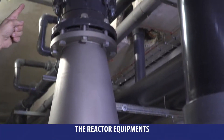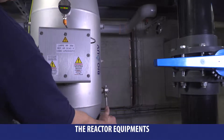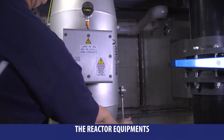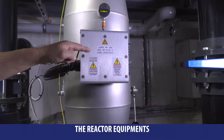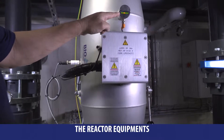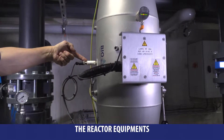The reactor is equipped with a manually operated cleaning system of the quartz, but as an option, it can also be equipped with an automatic cleaning system. Each dechlorinating system is equipped with a water flow detector that prevents it from running without water passing by. The UV sensor allows controlling and regulating the lamp's power.